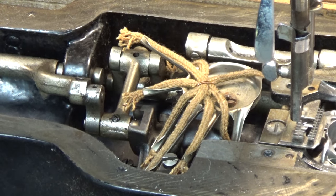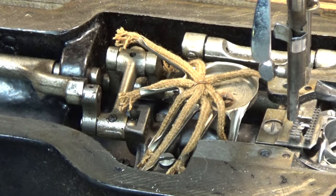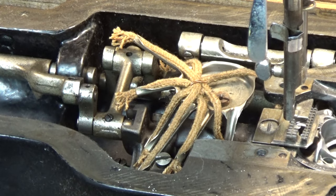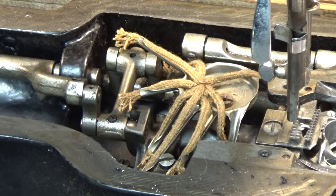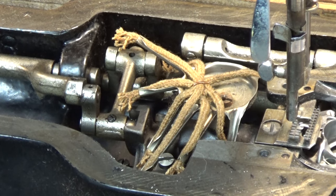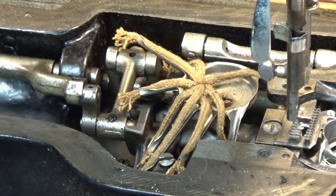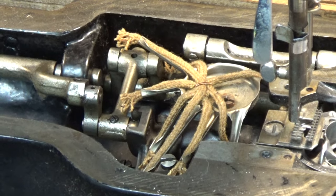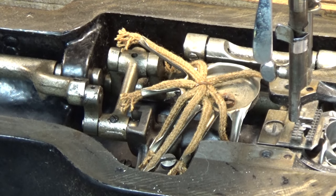And who knows, maybe the previous owner before Chris used some sort of lubricant like that on the machine, and that's why the buildup was so ridiculously excessive on that motor and the other components as well that are adjacent to the motor. Remember again, I described the motor as a vacuum cleaner. When that motor is running, it's going to be sucking everything in the environment towards that motor. So just be careful what you use on your machine, and don't be tricked into using something other than standard machine oil. It really is the best solution when you're looking to optimize and have a machine run well.